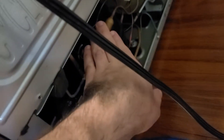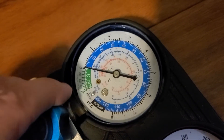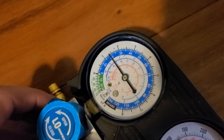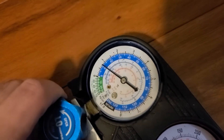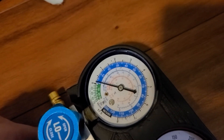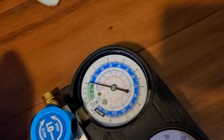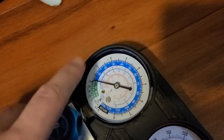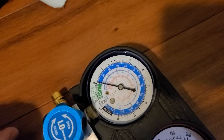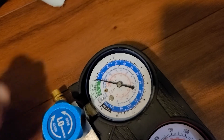It's nice and cold, but they're not freezing — just barely colder than everything else. Obviously the hot side is hot. The cold side could honestly be colder. Back to zero again. I want it to stay at three, honestly. That's my goal. Got to keep adding to it, keep an eye on the lines, see where the pressure ends up going. If it goes back down, put a little more in. Don't overcharge it, though.